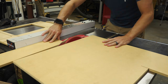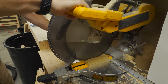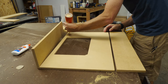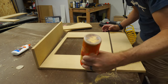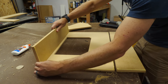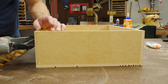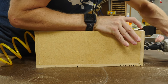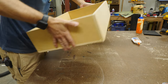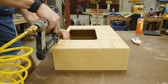The box for this was made out of half-inch MDF. I cut out the face on the CNC and then cut down some strips on the table saw to make the box. This is super simple construction — nothing special here at all — and it's all going to be glued and brad nailed together. I got all the pieces cut to size, added glue before laying everything together, and used some brad nails to hold the pieces to each other, but they weren't connected to the front yet.